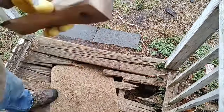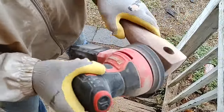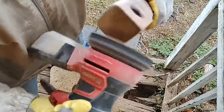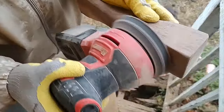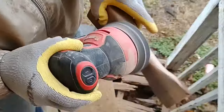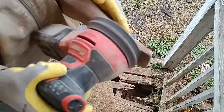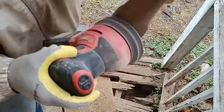That's a roundover bit. Now I'm sanding — started with 80 grit using my random orbital. I do have that squishy pad in between the sander and the sandpaper, which really helps you do contours. I know they sell specialized sanders for that, but I'm on a budget. I went from 80 grit all the way to 240.